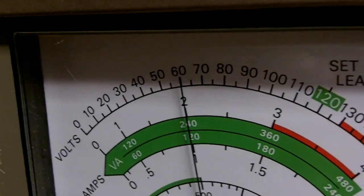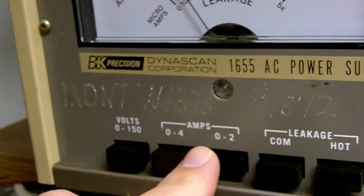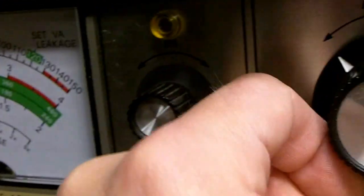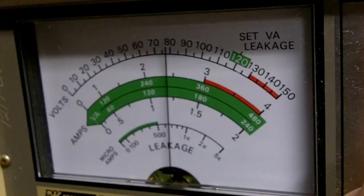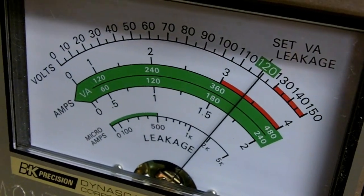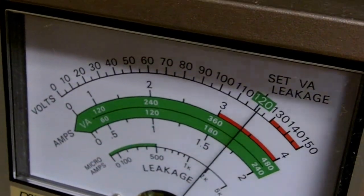Later on, I'm up to about 60 volts. Everything's looking good so far. Checking my current draw — just a little over about half an amp. Bring it up just a little more now — we'll go up to about 80 volts and let it sit there for a while. I do have a pilot lamp lit up, and the pilot lights behind the dials and meters are lighting up now at 80 volts. No signs of smoke, and voilà — I'm at 120 volts now, and the radio does seem to be working.